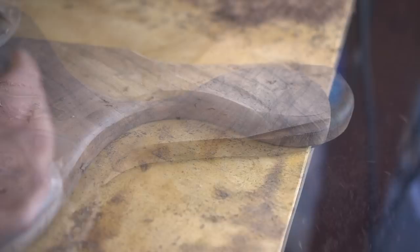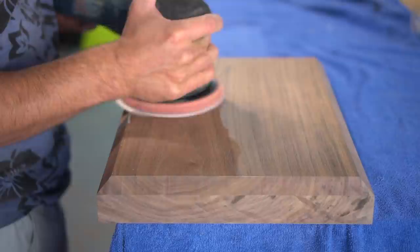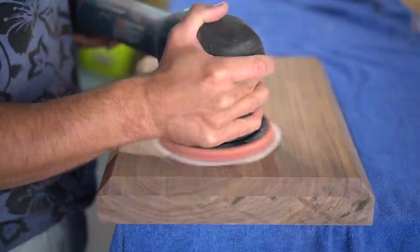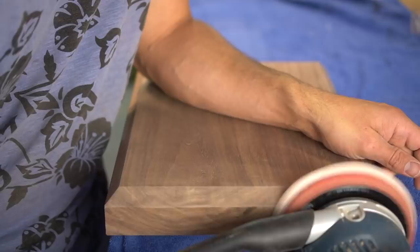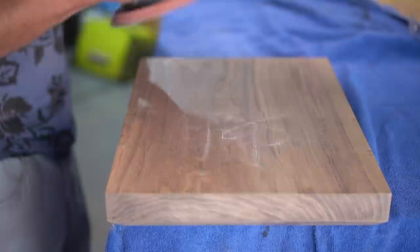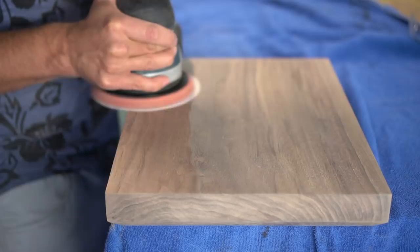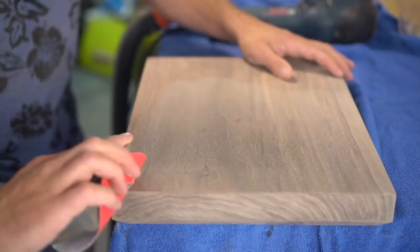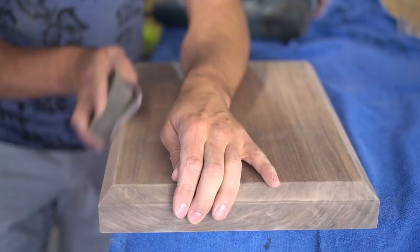Once you have all of your routing taken care of, it's now time for sanding. I'm going from 100 grit all the way up to 240, because I want a perfectly smooth finish in the end. With each board, I go from 100 to 150 to 200 to 240 grit. The tricky part is making sure you get all of those unique corners and sides. Before my final pass with 240 grit, I take a sanding block with sandpaper attached and go over all the sharp corners to gradually break them for an even smoother look and feel, then go back and sand the board with 240 grit.